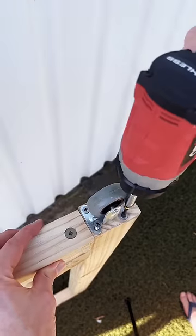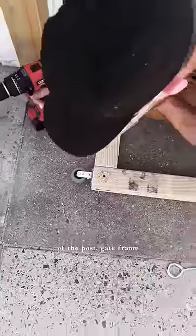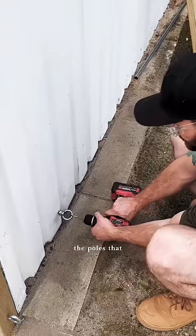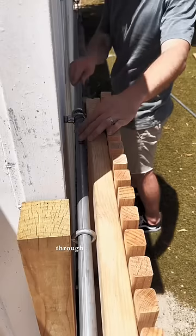After installing the wheels, I've drilled holes to add these loop hooks to the top and bottom of the post, the gate frame, and into the side of the shed, using a hook in my drill to spin them in. These loops hold the poles that keep the gate upright. Now to connect the gate, I thread the pipe through all of the loops.